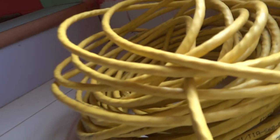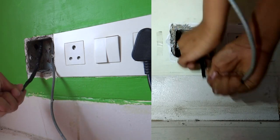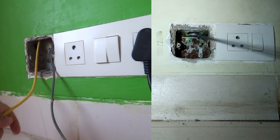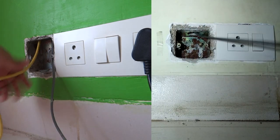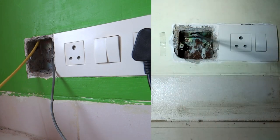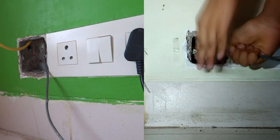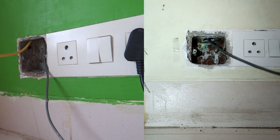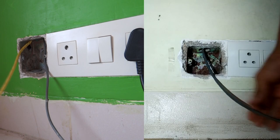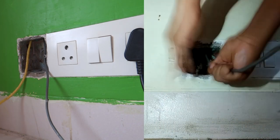As you can see we have approximately 20 meters of wire, so now we are going to start pulling it. The wiring is done with a combination of pulling and pushing — one person will pull from the other side and the other person will assist the wire to get inside the PVC conduit. It takes a long process. If it comes to a turning, make sure you don't pull it too harshly but at the same time pull it a little with force, and also feed it in correctly so that it passes through the turning.